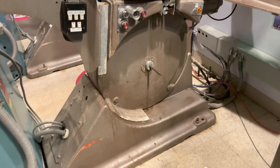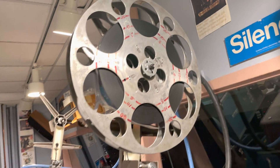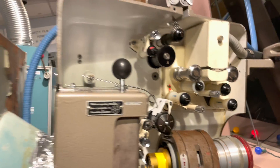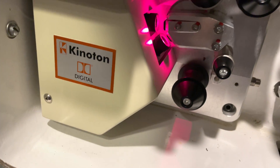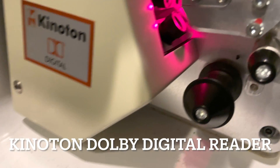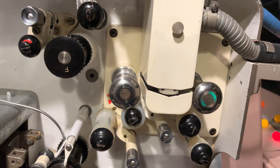Right here is the DP70. As you can see, here's a nice bottom view, and you can go up to the top. Up here is where you put the reel that's going to be threaded through. We run the film through here, and it comes out here to where the take-up reel will go. Notable features: this is the Kino 10 digital Dolby Digital reader. You can see we have a laser as well as a fallback to the old optical. We also have the magnetic reader here, which is for 70mm, so we're not going to deal with that today.